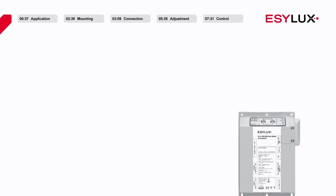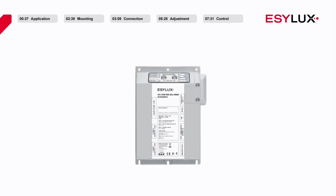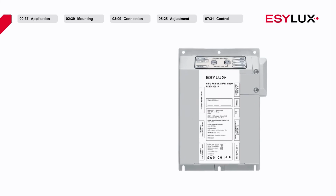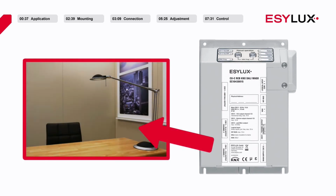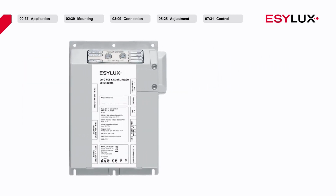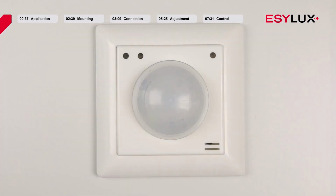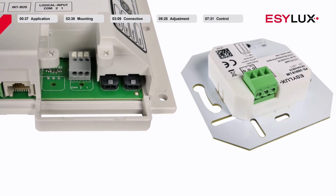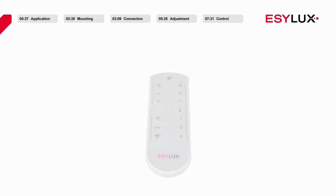Thanks to the predefined factory settings, the room controller box can be put into use without first being configured. ETS software or KNX know-how is therefore not required for configuration before you can start to use the room controller box. For devices that can't be programmed via ETS, the start sequence is as follows. 1. Activate the mechanical relay. 2. Deactivate the thermo output. 3. Local test for movement detection using the red LED behind the lens of the movement sensor. 4. Any DALI lights connected can be switched on or off and dimmed via binary input 1 and remote control input 1.